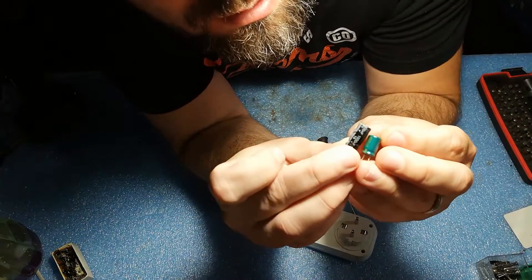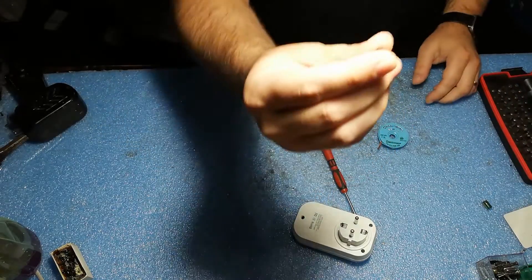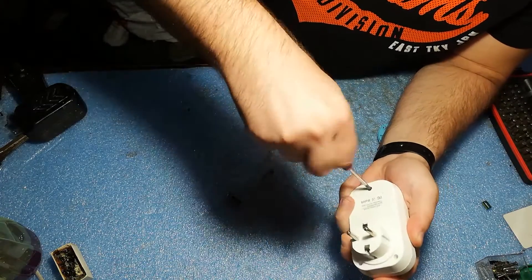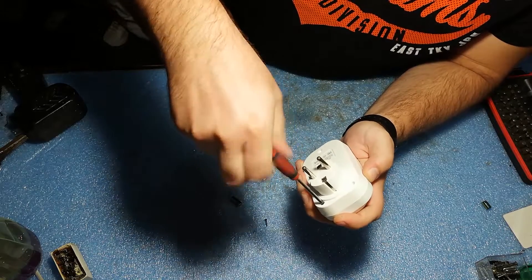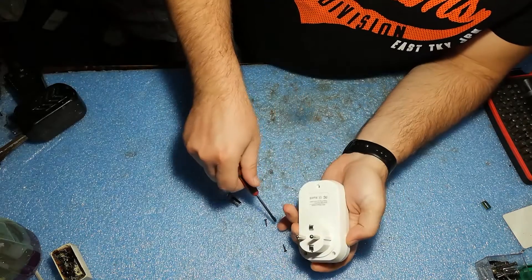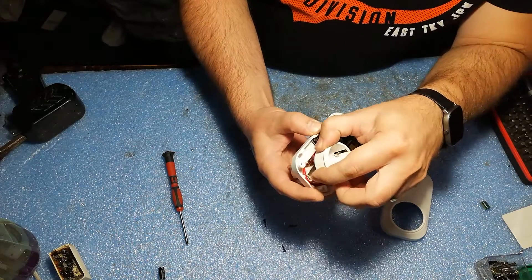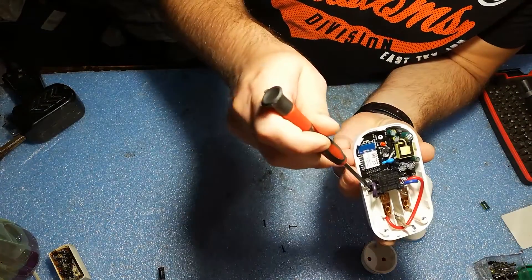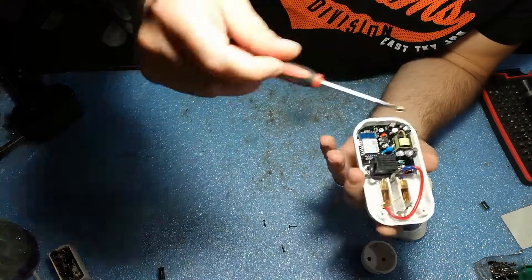It's a little bit higher, so hopefully it will fit the enclosure. Let's open it up. We have three Phillips screws to remove — one here, one here, and one here. Then this part comes out, and then we have an additional two screws, one here and one here, to remove. These are really short screws.